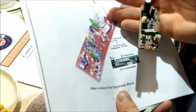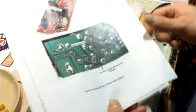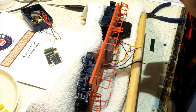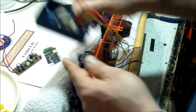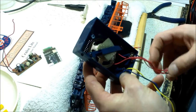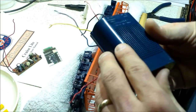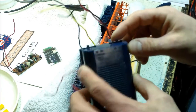My board is identical to that, so I can attach a wire there and it'll go to the horn pin — that should give me horn control. You'll need a soldering station for that. The other option if you don't want to use the original horn is to get the RailSounds board. I might do that since I have a nice speaker location. What I'm going to do is disconnect the original horn button since it's going on remote control now and just tuck those wires in the housing.